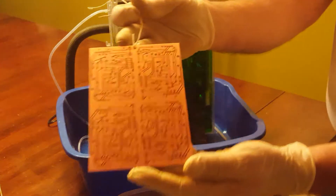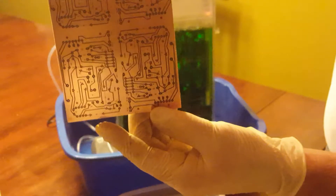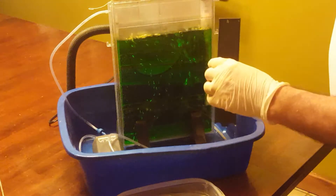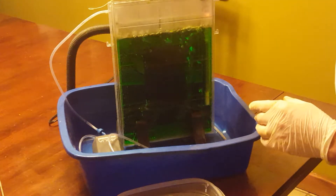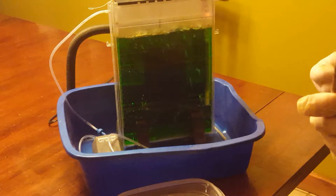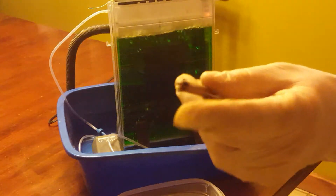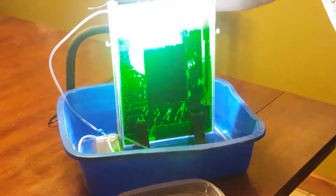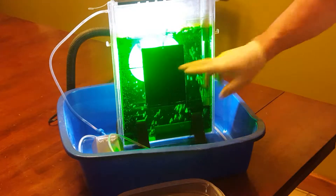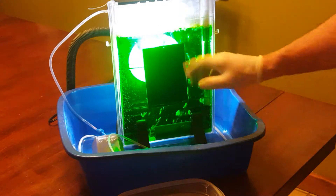When the solution starts out, it's clear and it etches very, very fast — you won't even want it heated the first time you use it. After use, this solution has etched probably about 30 boards and you get a solution of cupric chloride, which is what actually does the etching from that point. It's more controllable. This is the board — you can see the traces from the toner. I've drilled a small hole in the board with a piece of plastic wire through it, and we're simply going to drop it in the tank. Average time is maybe five or six minutes. You'll want a cheap tool for fishing things out that you drop in there — you can't get your hand in. I like to put a light behind it so you can see holes appearing as the copper gets eaten away.